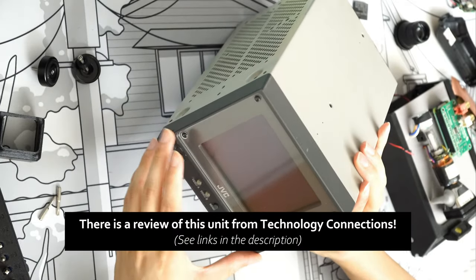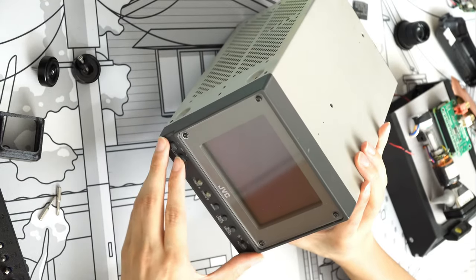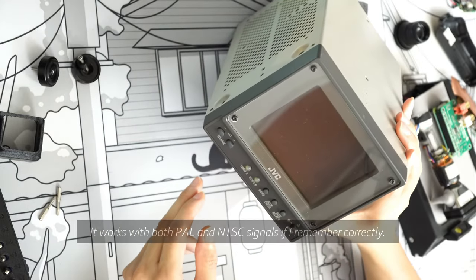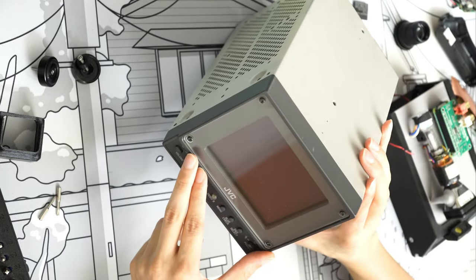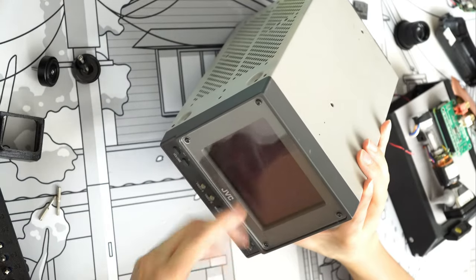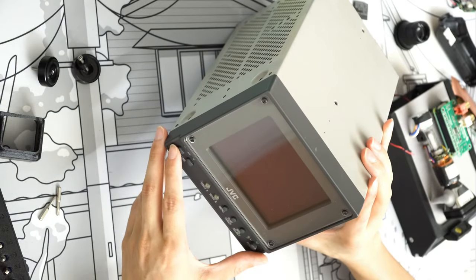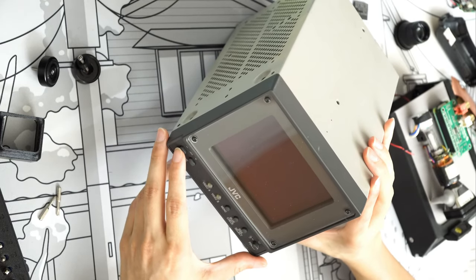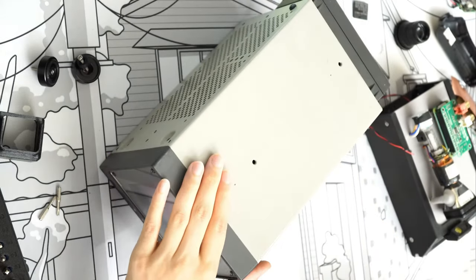And it does not flicker because, once again, this thing works at 3 times whatever frequency is being inputted here. Like if it's 60 hertz, because I believe this does 50 and 60, I might be wrong. But if you show 50 hertz, it's gonna actually refresh the screen 3 times for each frame to display each color. So it's gonna be 3 times faster refresh at 150 hertz, and 180 hertz if it's displaying 60 hertz. Really, really impressive. I love this thing.